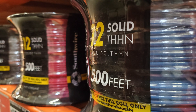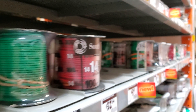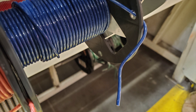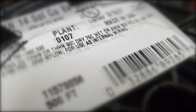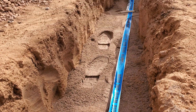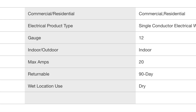Don't use THHN. While it might be tempting because THHN is cheaper, heat-resistant, has a lovely assortment of colors similar to tracer wire, and is readily available at a big box store, THHN doesn't have the polyethylene outer layer to keep it from deteriorating at an accelerated pace when buried. The service life of a buried water line is 30-plus years, but buried THHN is not designed to be in a wet environment and won't last that long.